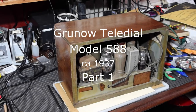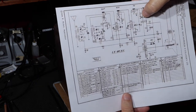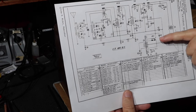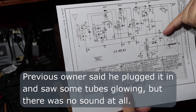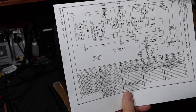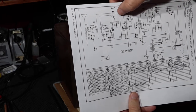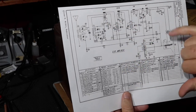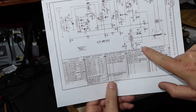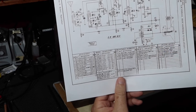Okay, so here we are back at the schematic. I was talking about the bias cell right here — it's like a little battery symbol there. And the transformer windings: the idea is if tube 80 is out, that will cause nothing to happen in the radio because there won't be any plate voltage. But it won't interfere with this winding here, which is for the filaments for the other four tubes. So that would cause them to glow. They're not hooked up in series — they've each got their own supply and return. So you could get glow with this still being okay, but then this would be the problem. That doesn't mean the transformer is bad.